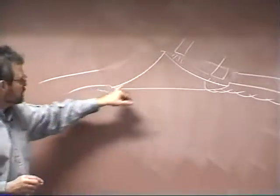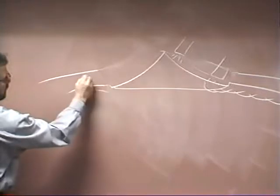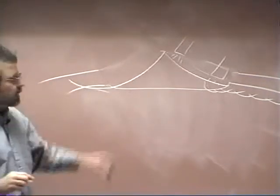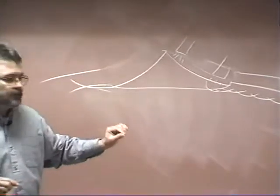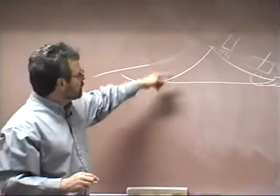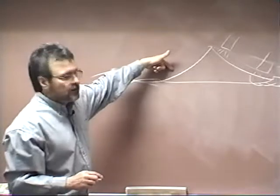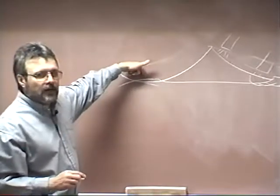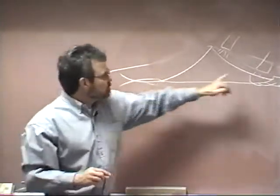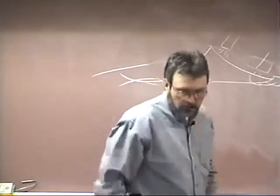Also, when you're preparing this, make sure that you don't grind beyond the end of the tack. If you grind beyond the end of the tack, you're going to start removing meat from the bevel, and you can get that pipe wall too thin. And if you accidentally grind that pipe wall, by the time you come down there, this tack's going to be thick enough to hold the heat, but then there's not going to be any meat in the wall of that pipe to hold that heat, and you'll blow a big old keyhole. So when you're prepping these tacks, don't grind past the end of the tacks. Okay.